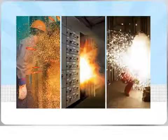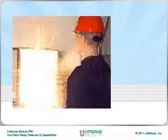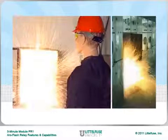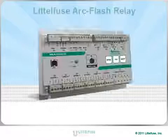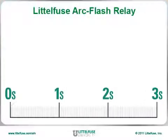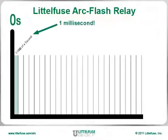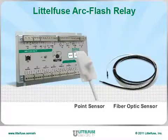Arc flash and electrical hazard risk should not be ignored in your facility. Arc flash protection should be used when working on energized equipment, and Littelfuse has a solution to provide this protection. The arc flash relay quickly detects arc flash events and sends a trip signal to a circuit breaker in less than 1 millisecond. Light sensors detect the initial spark. How does it do it?